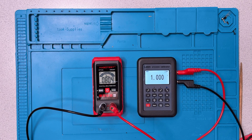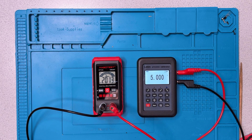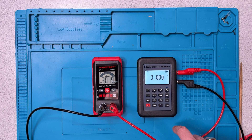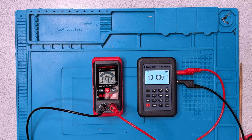I'm going to bring this up to one full volt, and we can see the meter is showing pretty close to one volt — I think that's very good for accuracy. Bringing it up to five volts it's showing 5.02; at four volts it shows 4.00; at three volts it shows 3.01 to 3.02 — pretty good. Bringing it all the way up to 10 volts, it shows 10.06. I think that's reasonably accurate; I wouldn't really be worried about differences in the hundredths-of-a-volt range.